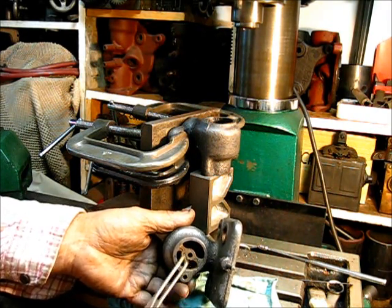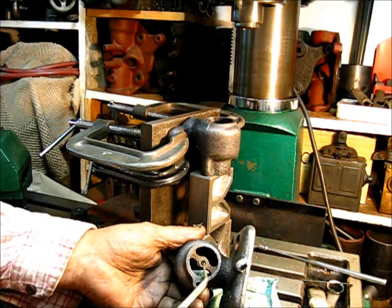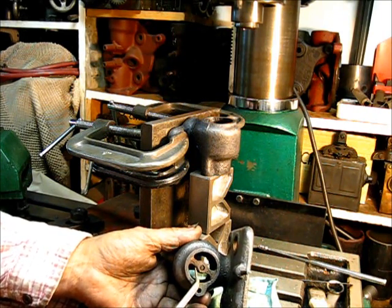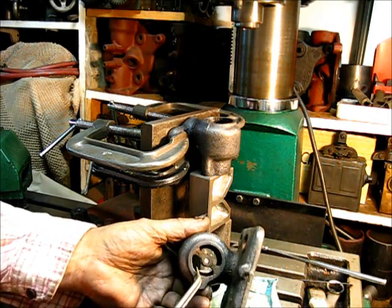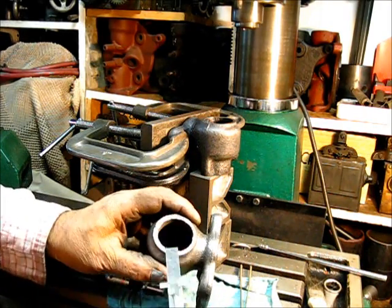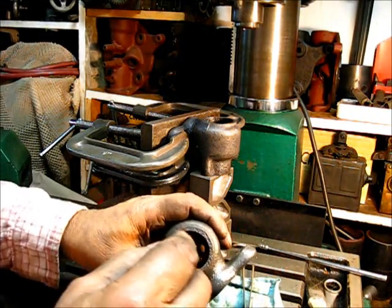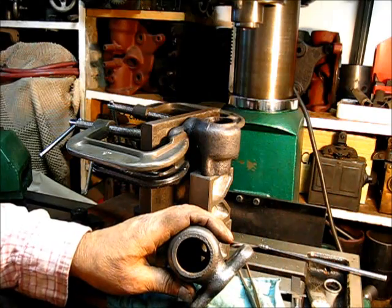And then you will find one that appears to have been drilled. The face up here — some of them are milled, and then some of them it's like there was not enough casting material there to mill. So there's actually no positive measurements other than the distance between this surface and that seat surface, and I found that to be one and one-half inch.